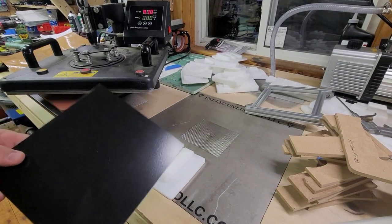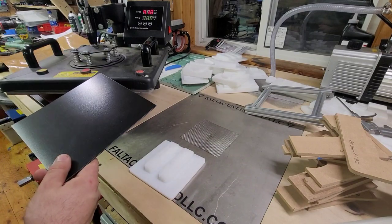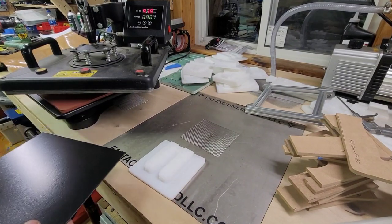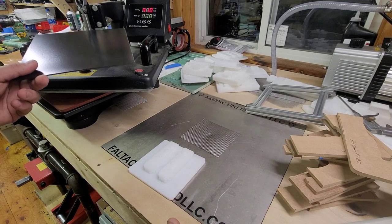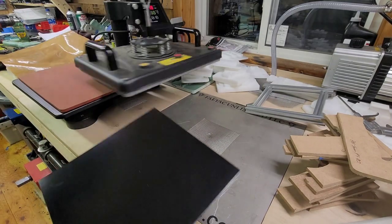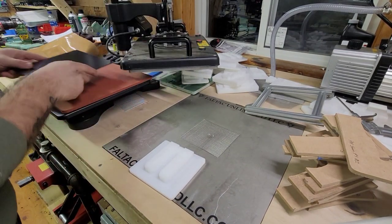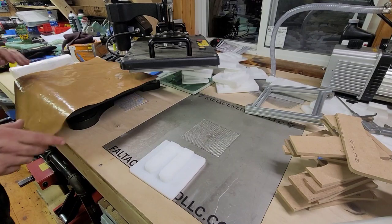it. So what I'm going to do, and also another trick is when you're dialing in, you want to take your Kydex. So this is a simple 8x8. It just happens to work on this, just barely, but it does. You want to take this, the heat press, throw it in there. And on this particular one, it's 410 degrees for 110 seconds. So I'm going to go ahead and throw this in here. So shiny side, grain side, shiny side up. Material over it.